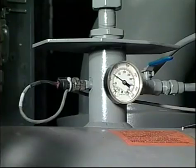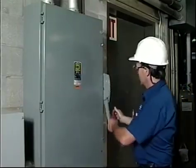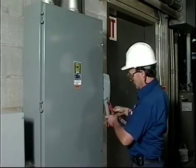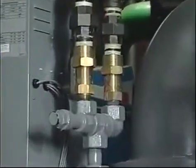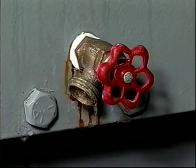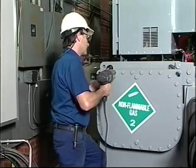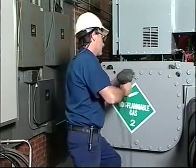Don't remove any parts while the machine is running or under pressure. When working on electronics, shut off the starters as well as the machine because automatic mechanisms may activate the part you are working on. When replacing any part, be sure to use only material that meets code requirements. Don't vent or empty water boxes unless you are absolutely sure of what you're doing. Don't unscrew water box cover bolts unless you are sure the water box is completely drained. Don't loosen any packing gland nuts unless you are sure the threads are engaged.